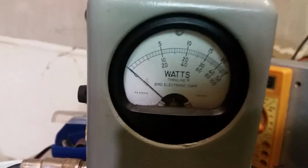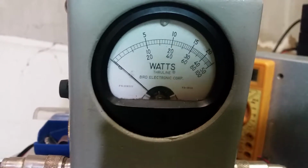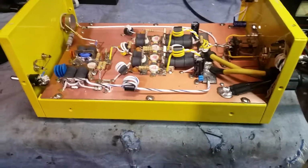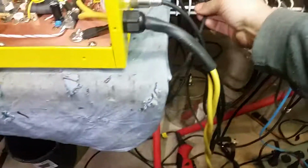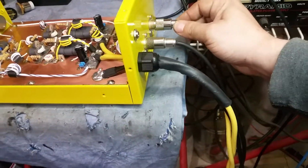Might be a good idea if I turn the box on. Yeah, so we're over there about 300 bird, which, oh yeah, that's right on the money, bud. Whenever I do a 5-pill or a 4-pill with a driver, if I can get at least 300 bird on the bench radio, everything's working good. All right, so let's hook up the hot radio. I won't even press pause, I'll just do it right here on camera. A lot of times I'll press pause, but I've got everything right here, so we can just switch it over like this.